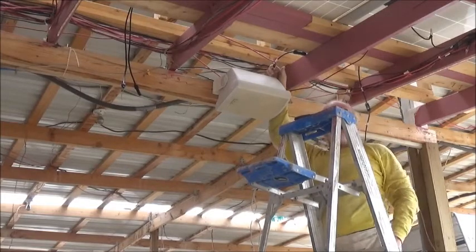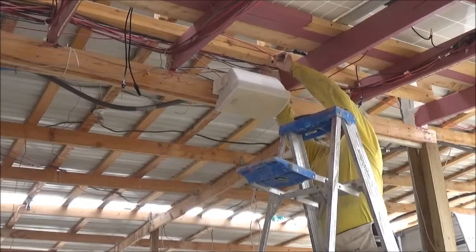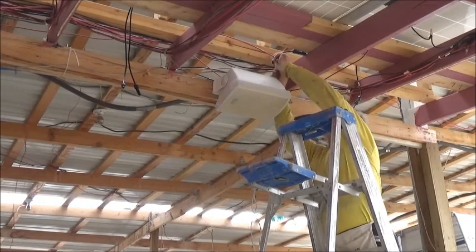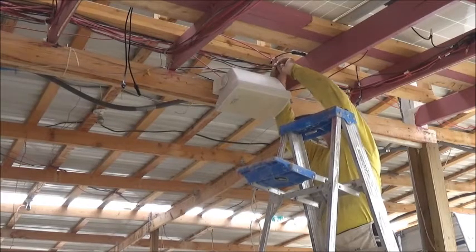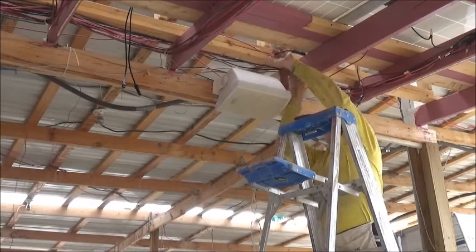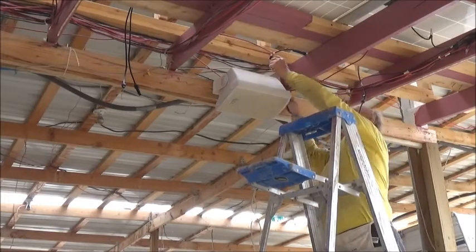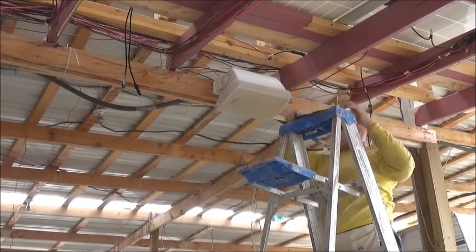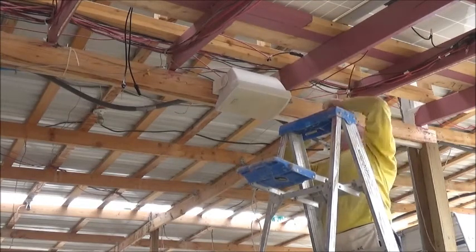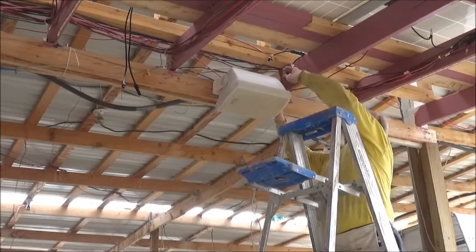Put the meter over here. Go over to my positive. Get a wire nut — put it in my third hand, which some people call a mouth — and connect the wire nut. The warranty on this panel would be intact because I haven't cut the plugs off, and I'm putting the wire nut on the other end of the plug. Now that's on, but tension gets put on these wires and it could pull them apart. So I took a wire tie — a plastic wire tie — put it about a half inch down from the connection, and to make it look neat, you cut it off. Connect, cut, repeat.